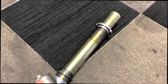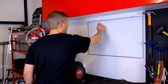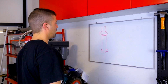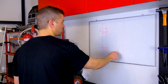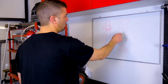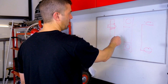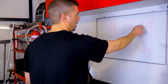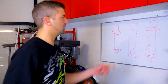I bought this whiz-bang drill bit here, so I'll get the plates done on the drill press and give it a whirl. So here's the plan — that's a jack, with a thread and a little thing to catch up. We've got to make a mount to bolt it to. It's basically just going to be a flat bar — we'll drill two holes in it the same dimensions as that, fold it twice so by the side it's going to look like a U shape with a hole and a hole, then weld a couple of gussets on each side, jack through it, nut on the top, bolt it to the frame.